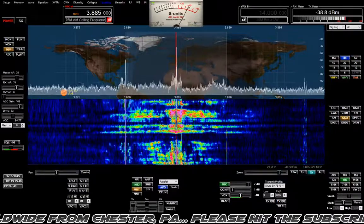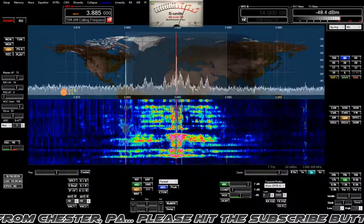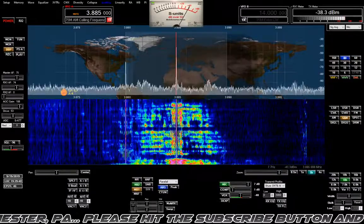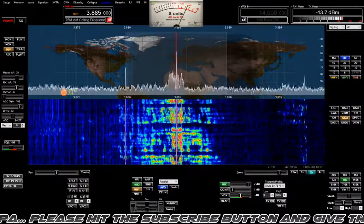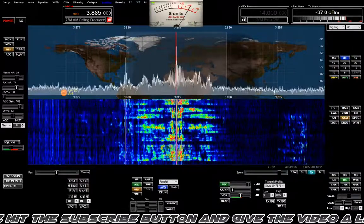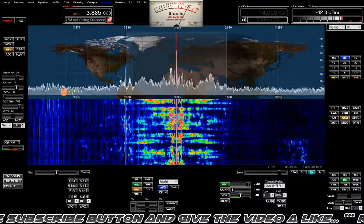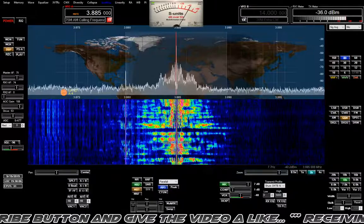It's gang-tuned — the VFO and the plate tune are gang-tuned, and they track beautifully. So you've got the coupling adjustment and the loading coil, which is very nice to have in a mobile situation. The last trip, something was wrong with my antenna system. I was like 3-to-1 SWR, 4-to-1 SWR — the ARC-5 didn't care. Still had 100 watts out and everybody heard me.